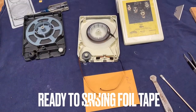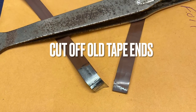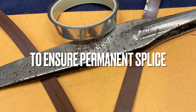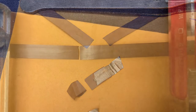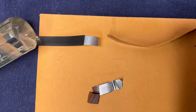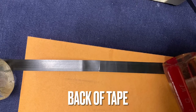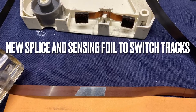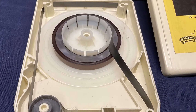Here is the whole tape back together — the parts are on it and I'm ready to cut off the splicing tape and the two ends. You can see how the tape just came apart, so I'm going to make two clean edges, take the old adhesive off, put it together as close as I can, and put the splicing tape on it. This is the back side — I'll eyeball it up and put the other end back together onto the splicing tape. And here you see how the entire splice is back together.